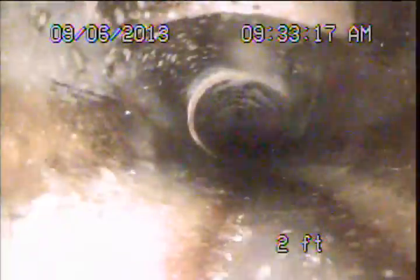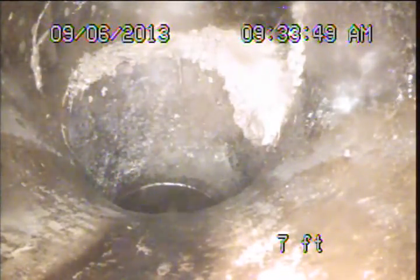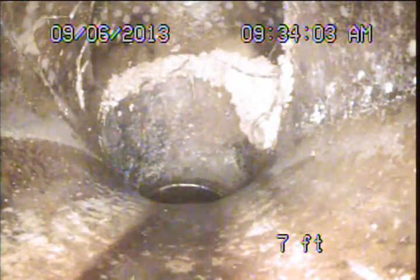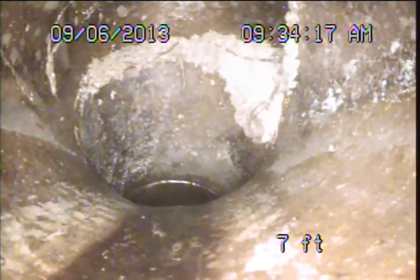As we come around into the clay pipe, we're seeing a little bit of shifting here, but not significant. These clay pipe materials are very common. This type of piping is expected to have a very long service life. It's a natural material so it's not expected to deteriorate underground like iron or metal pipes would, but it is more brittle in nature and does have a higher potential for damage during seismic activity or earthquakes. This fitting is starting to make a drop toward the front of the yard, and it looks like we've got some cracking starting to occur. Small amounts of roots and soil are trying to be pushed through that crack, which is not a significant issue right now, but it's very likely that it could worsen. So if no repair is performed now, we'll want to more closely monitor this area. This is a common place for these systems to crack because of the weight of the clay pipe pulling downward on that fitting.